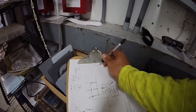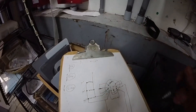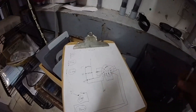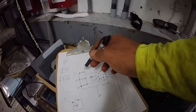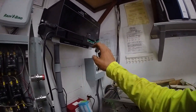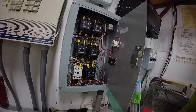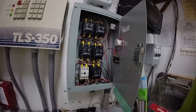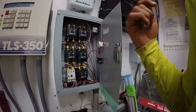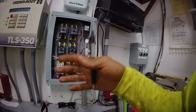From a different e-stop it goes to the breaker — we have our breaker in a panel. This goes back to the neutral of the panel. For all we know, this red wire might go in there and do some other logic that also shuts down these pumps. If we do go forward with shutting down the pumps to this gas station — I was telling the crew over there — just shutting it all down so we can work on it. We'll find out, because we'll press this e-stop button and all six of these contactors will shut down.